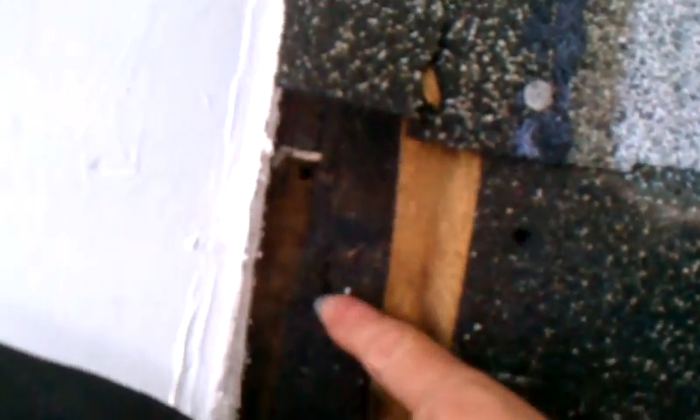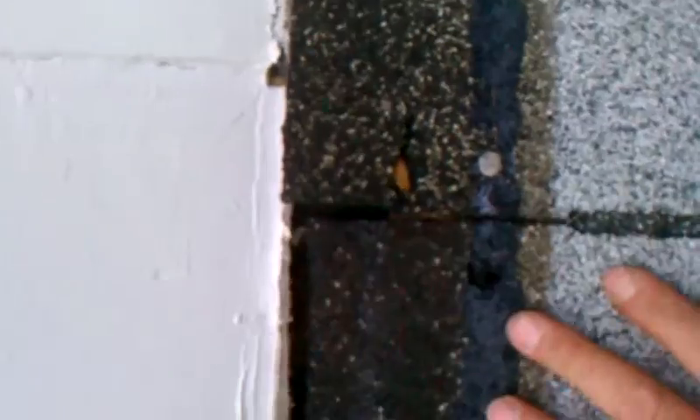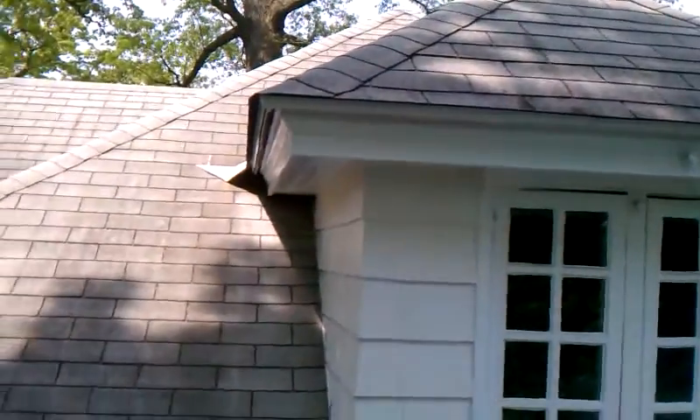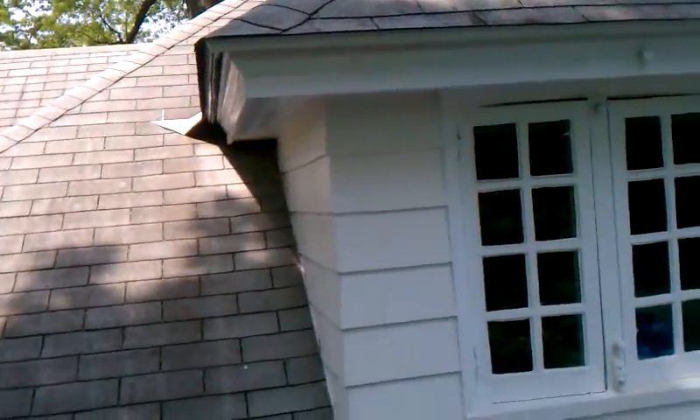Here's the second roof — this is where the shingles end. There is no flashing material. I don't even see flashing under the wood shake, but it had to have had it. There's only so far you can go with something like this. Basically, that's the problem: they used no new flashing when they did the re-roof, or re-shingle-over as they call it up here.